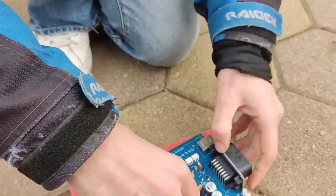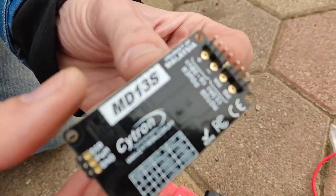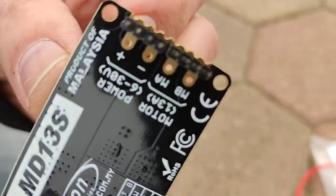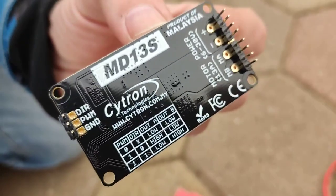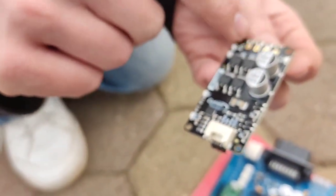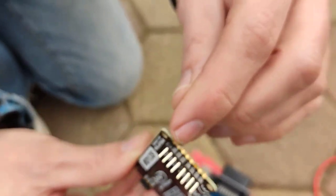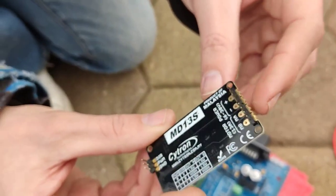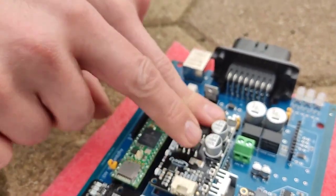Can you take out the motor driver? I can try, I'm not quite sure. Show the other side — you have to solder-weld here. Actually it's 8-pin. Why is it 8-pin? Because it can do like 30 volts, 30 amperes — something that's pretty overkill. And when you try to push 30 amperes through, I guess you need that. It's also soldered — that's a tricky one. You're using the very edge. This is how the edge looks. So this is not a hole, you have to solder to the edge, and then it pops back in.